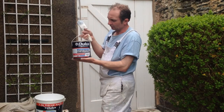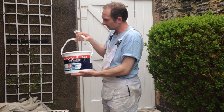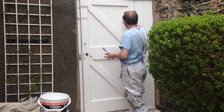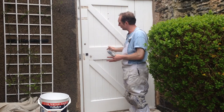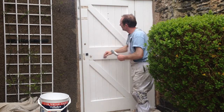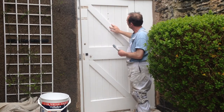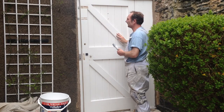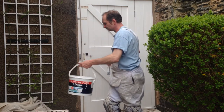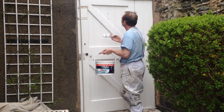It's well worth buying this Weathershield. I'm just going to use this big tub as a kettle — I find it easier. For this purpose, I'm just going to undercoat this section here, otherwise I'll run out of video time. Basically, what you've got to do is do the inserts first — all these — and then do the flat parts. The reason being, if you start undercoating halfway across, the paint can start drying before you complete that area, and you'll get a dry patch. Don't put too much paint on the brush in one go; use a kettle to bang any excess off.